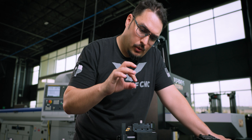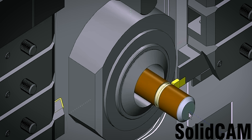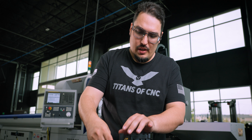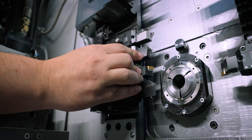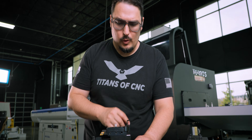What I think would be really useful is if you had multiples of these holders and set them to the exact same length. Then when an insert wears out, all you have to do is just change out the tool — take it out, pop your new one in, tighten it down, push the start button. The tool's exactly the same as the previous one, and you're good to go.